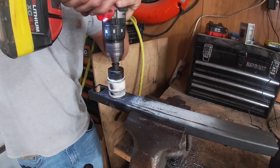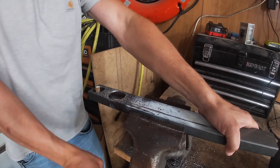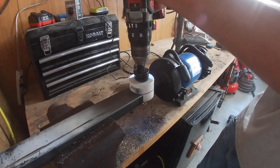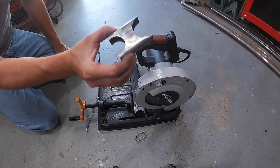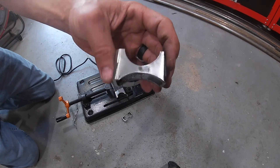I had to make these metal brackets that will be welded to the bicycle frame. They'll fit the outside casing of the right-angle drill and keep it in place, because when you put a lot of torque on it, it not only wants to move around but it also wants to twist. There's a lot of pressure on it to move this 26-inch rear wheel, especially when there's a person on the bicycle.